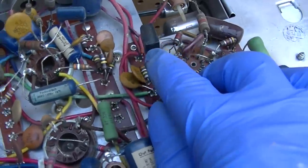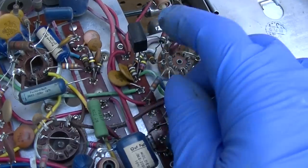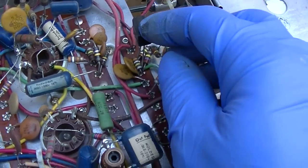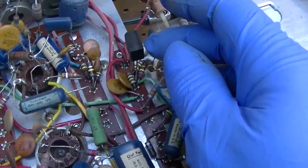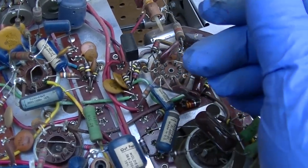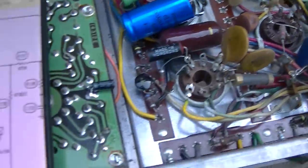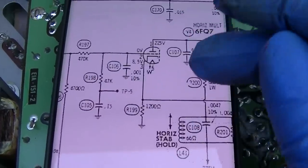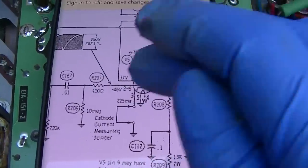The older ones use the tube version of it. These are a very high failure rate. If you ever acquire an old tube caddy from a television tech, the odds are there's going to be two or three of these floating around in there — very high failure rate. In some sets they're actually socketed. And what this causes is a soft horizontal lock, like you see. We're going to compare how many rotations we get after we replace it with two silicon diodes. It's all the way at the back, just two diodes that point at each other. And that's where it is in the schematic.